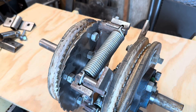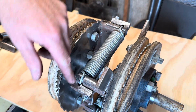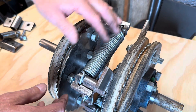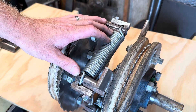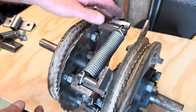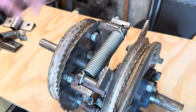You can see here how one side of the spring is attached to this side, and the other side of the spring is attached to the other side. As you wind it up, the spring extends. One thing about using extension springs in this application: you can only get a quarter rotation because it bumps into the center axle.